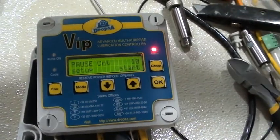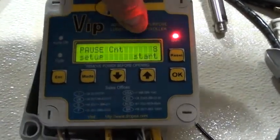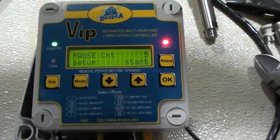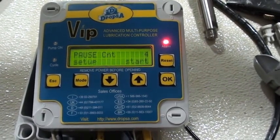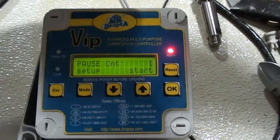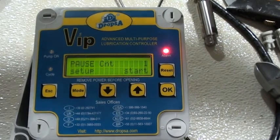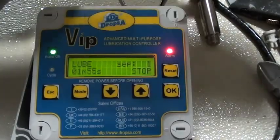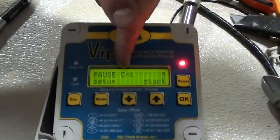I'm going to send in an input from something that is set up on a PLC. Your inputs would be pins 11 and 12, and as you can see, it is counting down the pause counts from the PLC. These are the pulses coming back from a mini PLC that I have set up on pins 11 and 12 inside the controller. You'll see now at zero that we've gone into the lubrication cycle, and we're looking for one count of the SEP, which is our ultra sensor. We're going to give it a shot of the ultra sensor, and now we're looking again and counting down.